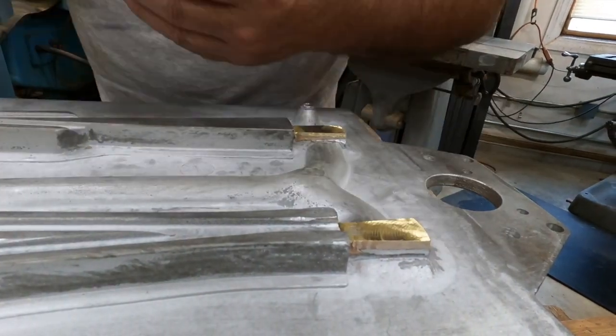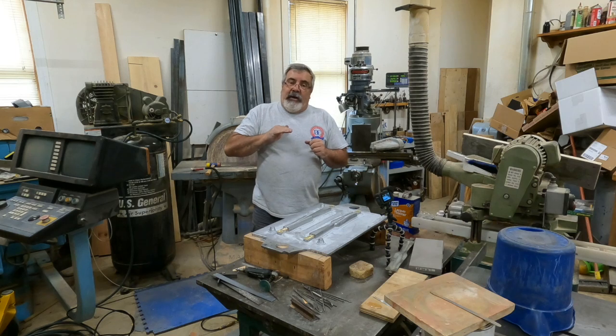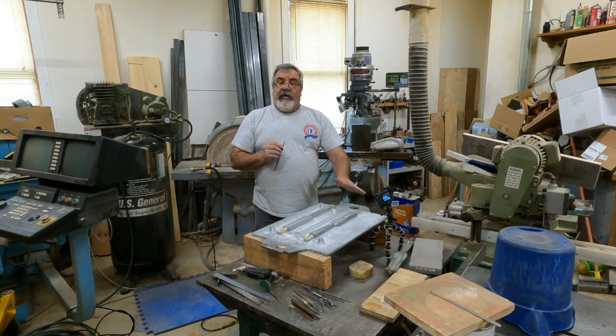So that's basically like, like I say, when you hand plane a lot of times, I can use the sander, but it's going to be wavy. If you take the hand plane, you're going to make that nice, straight, smooth, and that's what we want in pattern making, right? So that's why I took this. We'll finish it up. That's all you've got to do on that.